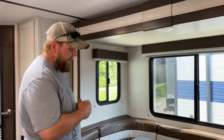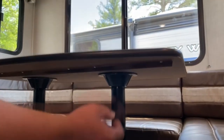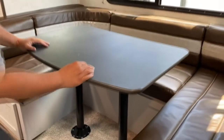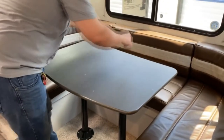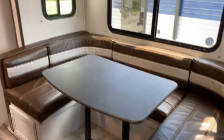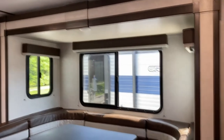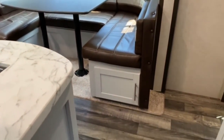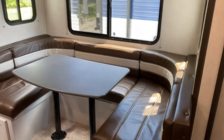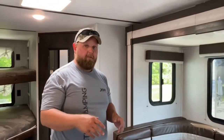On your kitchen dining area, these will pop out. Take this table and put the table with the lips around here. You can put the poles in the lower storage. Put the cushions on the lips — these two cushions go right in the middle like a bed. When you go in and out with your slide, just make sure there's nothing in the way — nothing on the floor, especially rocks. A rock on the floor can scrape the floor. Once you push the slide out and it stops, you're good to go.